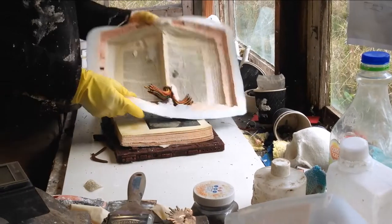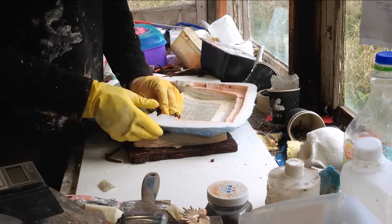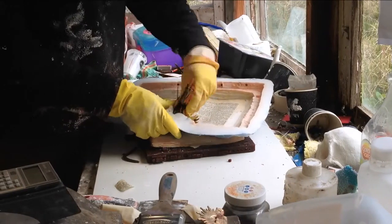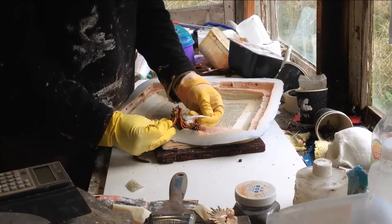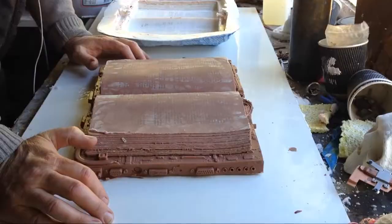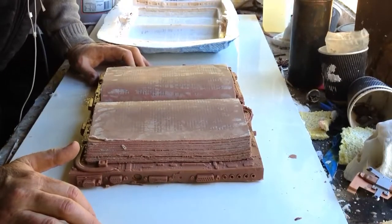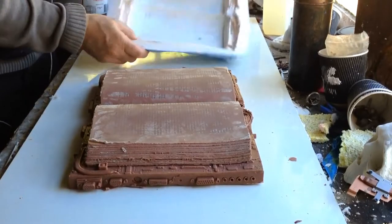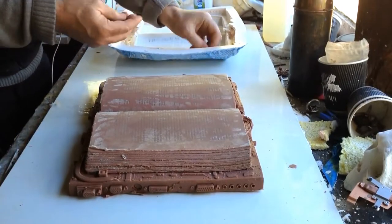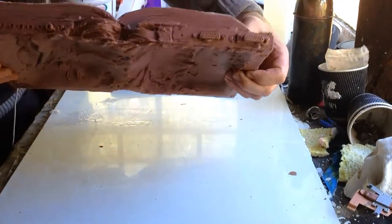That's done. The mold definitely needs these wires deeply embedded, but just a little bit of time gently pulling that out and it's coming out nicely. You're always going to get rubber flowing in different areas — it's going to be confusing. It's going well. I've basically cast the monster clay, which once you heat it up turns into a liquid, and I put it into our rubber mold here. It's come out pretty good — basically all the details are there. I'm loving it.